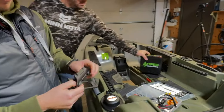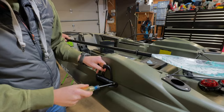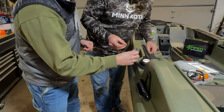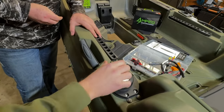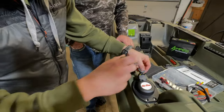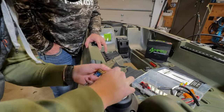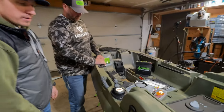The paddle clip is super easy — it has a rubberized keeper that just snaps onto the back. Because the inserts in the boat are brass, whenever possible use a standard Phillips screwdriver, or if you use a drill, put it on low torque. The steering assembly includes a tensioner knob you install first; when steering, it locks your rudder in the direction you want to go. Take the bolt, drop it into the bottom of the steering ball — don't screw it all the way down, you want the ball to have play so it spins. Get it about halfway down, line up the indexes on the cap, pop it in, and you're ready to roll. You can lock it in the straight position when your drive is in motorized mode.